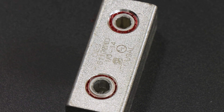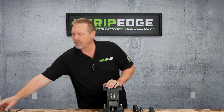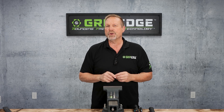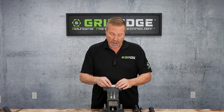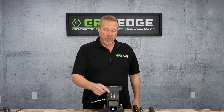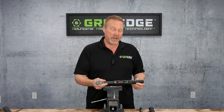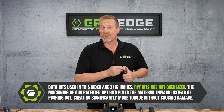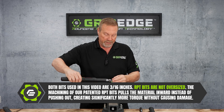Let's go ahead and pull that out of the vise and just have a good look at that — you can see how it rounded that out real good. I gotta be honest with you, I would have thought it would have taken more than 17 foot-pounds to round out that screw, but the aluminum is pretty soft so I guess it is what it is. Let's go ahead and drop this back down into the vise and grab the RPT and see how it does. I've reset this torque wrench to 30 foot-pounds — obviously there's no need for 70 if it's gonna strip out at 17.